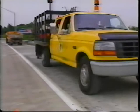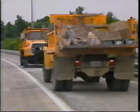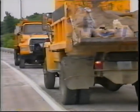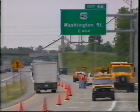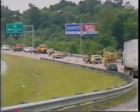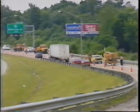in the future, restrain the crack from future lateral movement, and allow the retrofitted load transfer system at the crack to function as a hinge. Thus, all future pavement expansion and contraction will occur at the pavement joints where epoxy-coated dowel bars are in place. Field monitoring of the pavement performance over the next 3 to 5 years should reveal if this pavement evaluation is successful. If successful, this pavement repair technique will give the pavement engineers another rehabilitation tool to extend the life of our Indiana pavements.